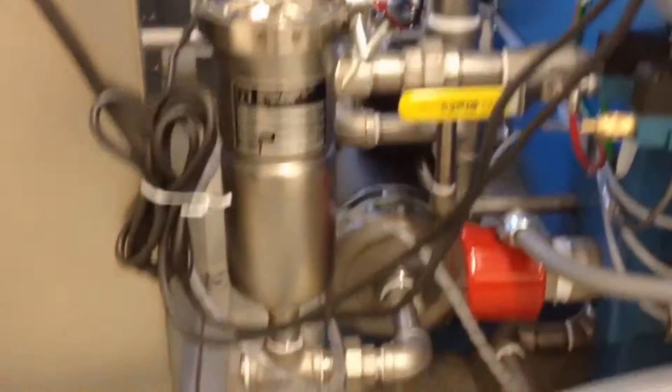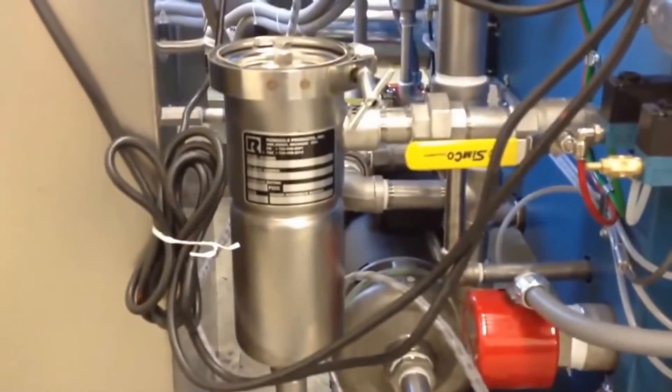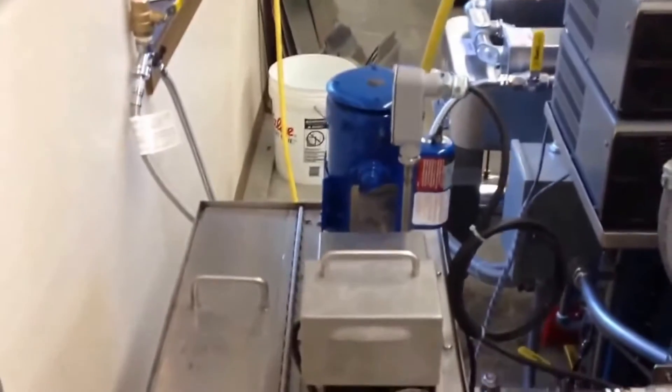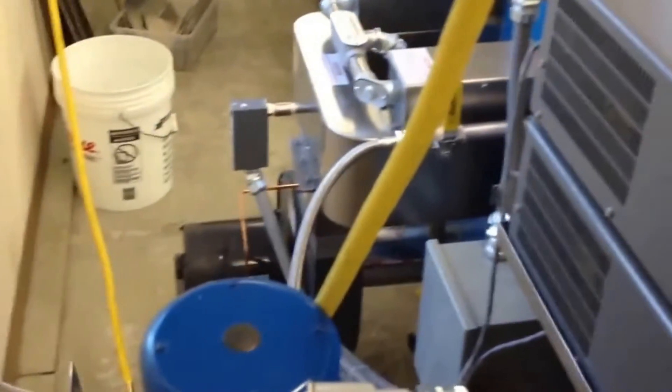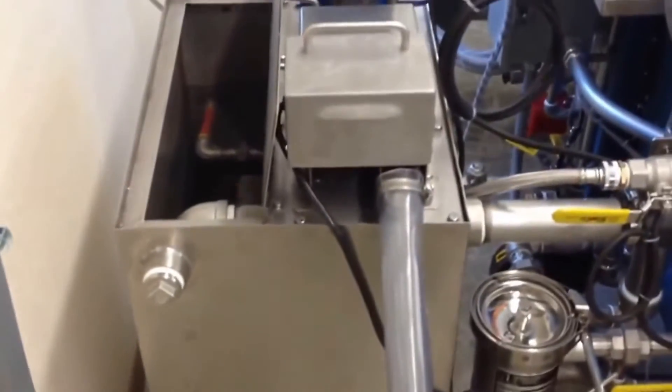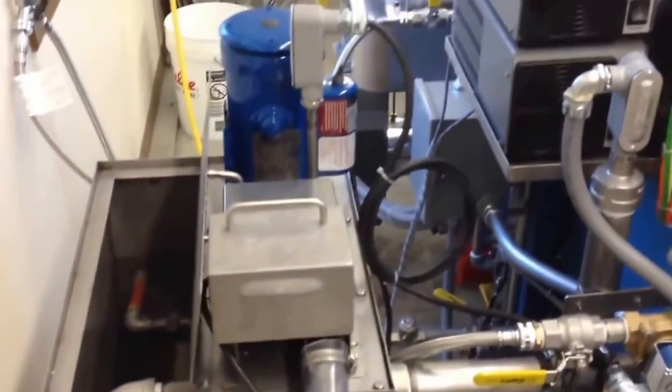The pump for turbo filtration, with a bag filter and oil removal system, pumps fresh chemistry back into the tank. It has a quiet tank in here with a belt skimmer for skimming off oil that can be dumped into another reservoir for dumped oil.